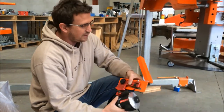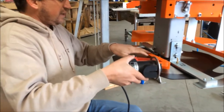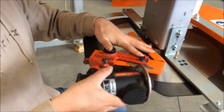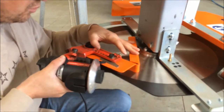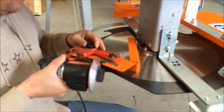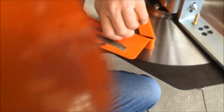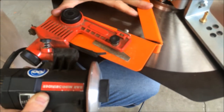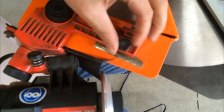Once you've got that blade on, throw it up here, rotate your blade around, place that bracket against your arbor and place your hand here to steady it. Basically what you have to do is swivel the face around so that you can move this whole bracket around, aligning the face of the diamond stone to the face of your tooth. Once that's aligned, lock it all up.